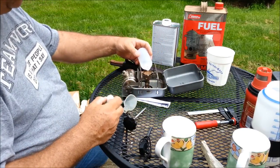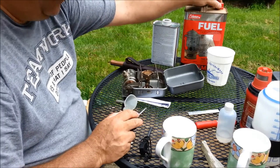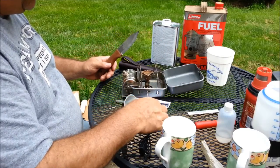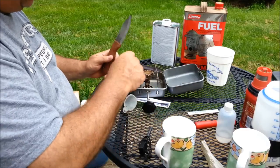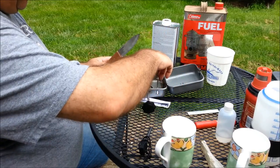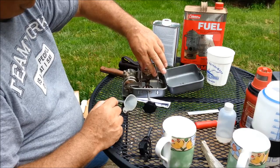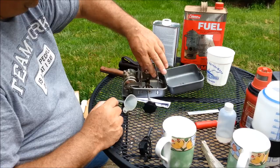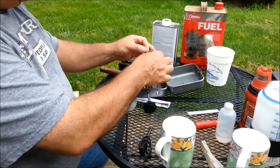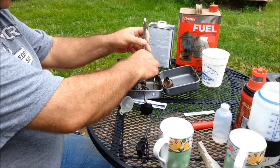I'm going to pour some alcohol in here. Let's go through the priming procedure again — we have white gas down in the bowl down there. All these lids are on. I think we're ready to try it. The valve is closed, so I've seated the valve, and at the same time that's pulled the block and the pin through the... wait a minute, there's something here I didn't do. I didn't tighten that jet — that's still loose. Let me get a tool and correct that. So we're going to tighten the orifice or the jet. Now we can put the burner head back on. By the way, if one of you has a manual for this, I would certainly appreciate a copy — I did a little internet searching and apparently someone is reproducing the manuals.